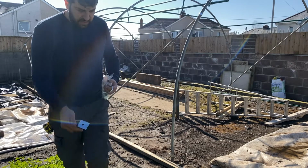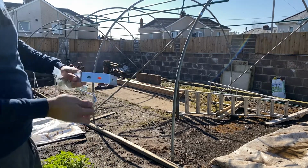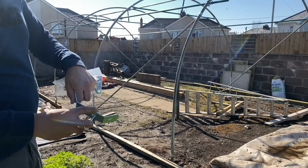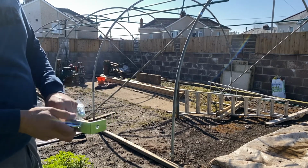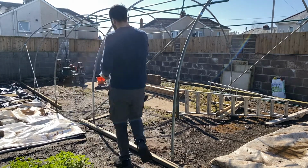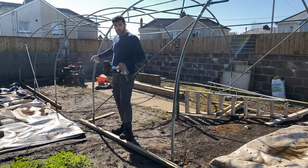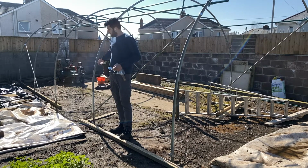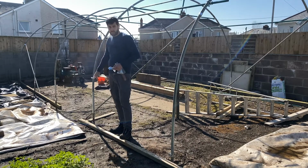So these brackets will sit on the inside corner of the tunnels, we'll put them together with a nut and bolt with some washers, and then the wood bolts onto the side of it. Then intermediate rails on the hoops. We've got another type of fixture, with a bit more detail, to have the bolts through. Again, we'll do a mid rail and a base rail.